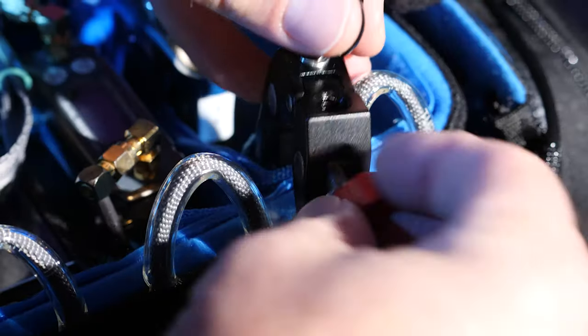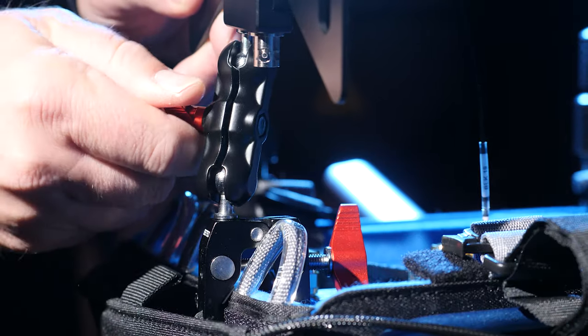A quick overview of the Bowtie Antenna: this is a small, compact, wideband antenna that is omnidirectional and designed for use in the sound bag. Each antenna comes with special bag mounting hardware and two coaxial cables. The benefit of using a system like this is that you would have more than a quarter wavelength between two antennas to help diversity systems operate more efficiently, allowing you to combine multiple receivers in the bag assuming you have the proper RF distribution hardware.